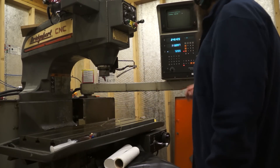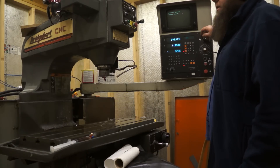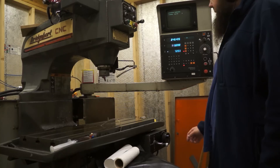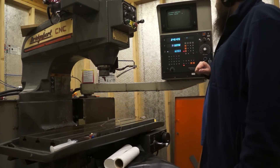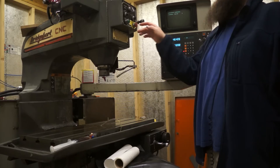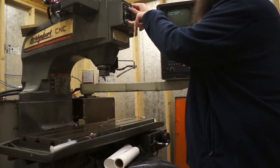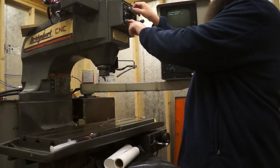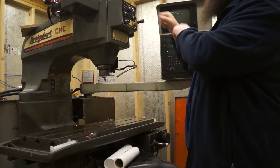The servos are off. This here pulls in this giant contactor and brings the servos up — that's servo power. So if I then touch one of the e-stops, it turns it off. The e-stops latch, but you can also just push them temporarily and it just stops things. It's got fun things like hold down the spindle enable, kick it to start and it pulls the contactor in and then it latches until you flip it off.